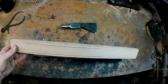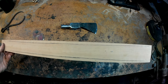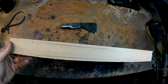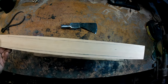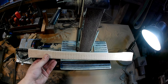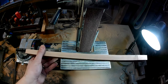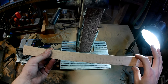On the reverse side I've gone ahead and traced that pattern on there. Now using either a belt axe, a rasp, or in this case a belt sander — because it makes quick work of it — we'll remove the wood up to that line and that will give us our basic profile. Using the belt sander I have removed all the wood up to my pencil lines, getting the flared look: starts thick up here, narrows down, and flares back out.